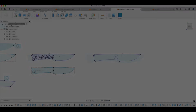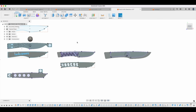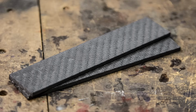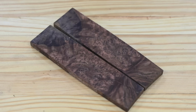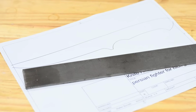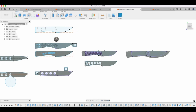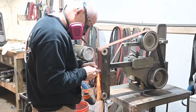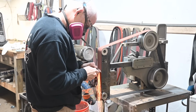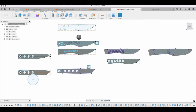Okay, so the next thing that I always think about is materials. Are the handles going to be micarta, wood? Are you going to make the knife out of Damascus steel or carbon steel versus stainless? It doesn't necessarily seem like you'd have to think about them up front, but in many cases you do. Just to give you a for instance, let's say you're going to make it out of carbon steel. So you say, well, carbon steel rusts, so I want to Cerakote it. Well, I want to make an integral like this, for instance.